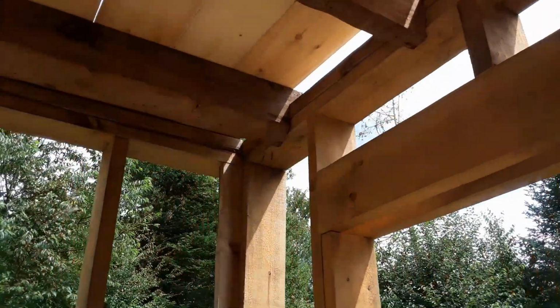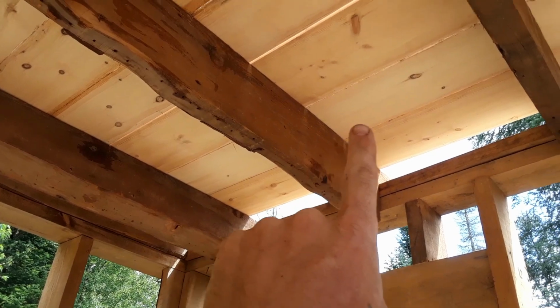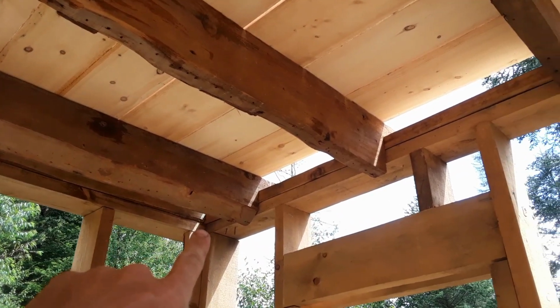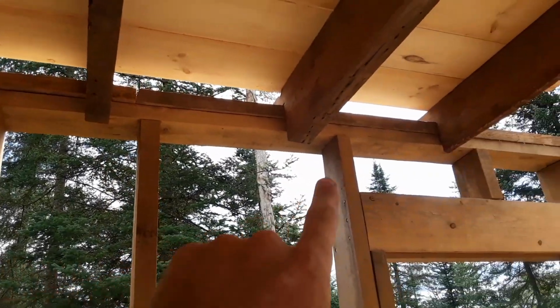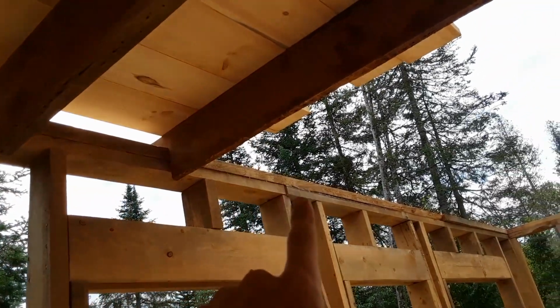because the rafters will be just, let's see if I can point them out. So there'll be a rafter at this corner. These are 4 feet on center, so these joists are 24 inches on center, 2 feet. The rafters, since they're so big, will be 4 feet on center. So there'll be one at the corner, one here, so it'll be resting right past this joist. Another one there, right past this joist, and then there'll be one right in the middle of the house.